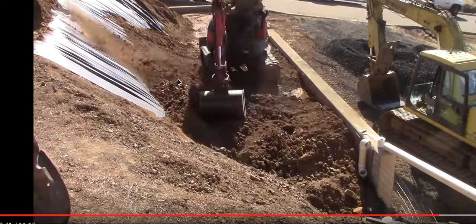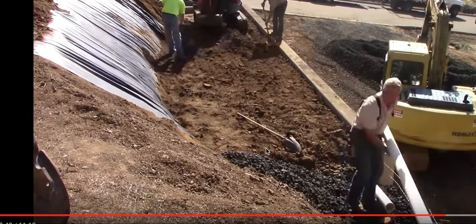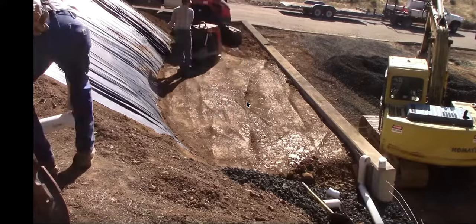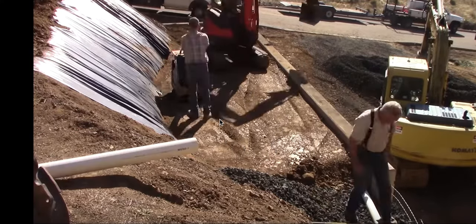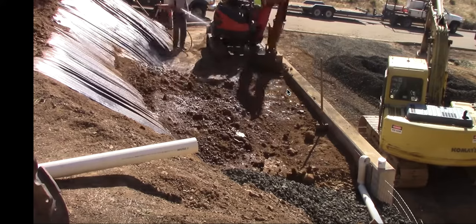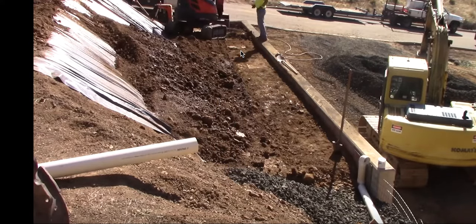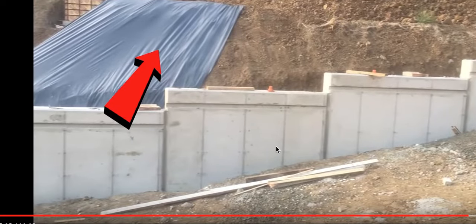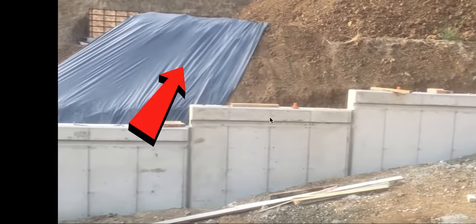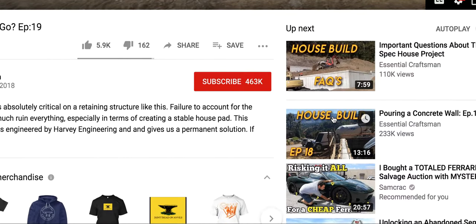Keep in mind that as you're compacting against a retaining wall, the vertical load you're putting with that compactor — which is measured in thousands of pounds — is also translating to a lateral or horizontal load against the face of the wall. As you hammer down on the backfill, you're also hammering sideways on the wall. He's only compacting the backfill to maybe 60 or 70 percent as per Broda's instructions, but he has no tool to test that — so he doesn't know what he's actually doing.